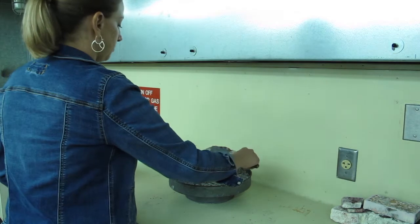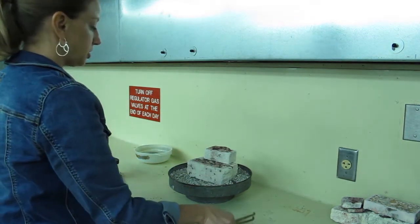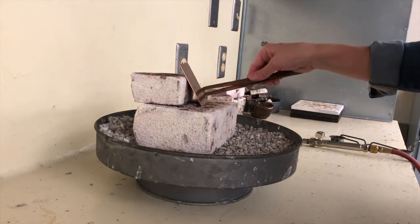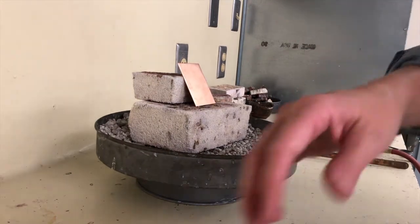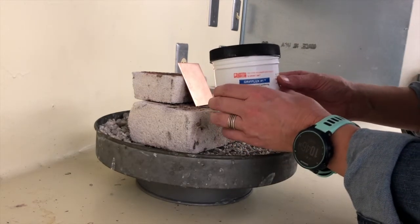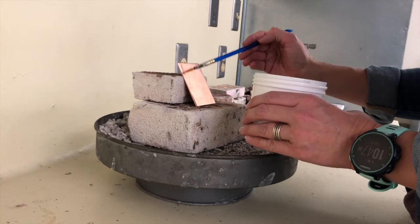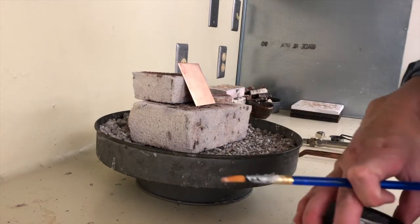I have some water in a quench bucket. Make sure you're using tongs because it's hot — just copper tongs. I've quenched it in straight water. Now this spot is really hot, so make sure you use tongs to place it back up again. Having a brick behind it is a helpful way to make sure that the heat reflects. The next way I'm going to show is using grip flux — or whatever flux you use for soldering. The cool thing about flux is it is going to become mirror-like or glassy at the same temperature of annealing.